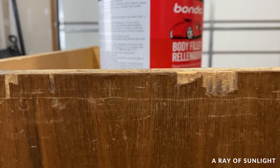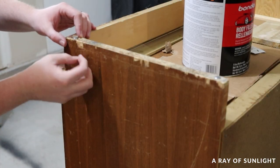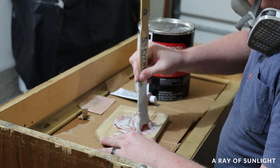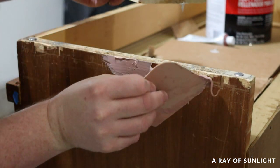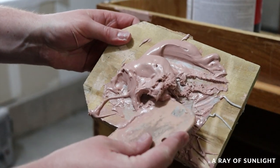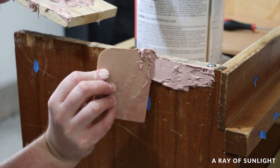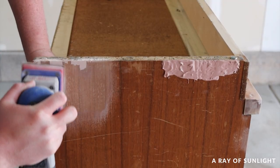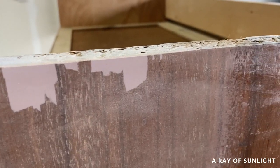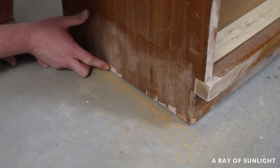Before we could dive into painting, we still had a lot of repairs to make on all of the chipped veneer at the base of the dresser. So we flipped the dresser upside down and chipped off all of the loose pieces of veneer. Then I filled in all of that veneer. My wife also has a video on this process, so we'll link to that as well. I made a newbie mistake and let the bondo harden too fast, so I had to mix another batch of bondo to fill in the rest of the chipped veneer. Once the bondo was completely dry, I used our sander to sand all of the excess bondo off. Then I used wood filler to fill the smaller scratches and dings on the dresser and a few spots on the bondoed areas.